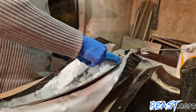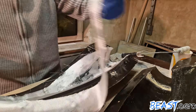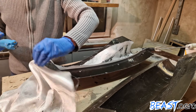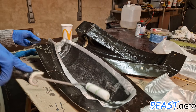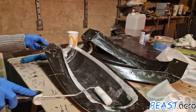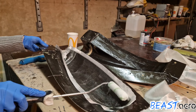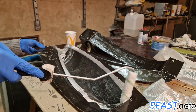Don't forget to always cut away excess material — it's just added weight and in the worst case it can even pull away the edges from the mold. And here you can see me already working on the second layer. You can spot trapped air bubbles by their white color; just roll on epoxy until everything has a uniform black color.